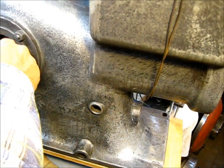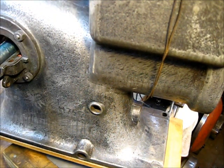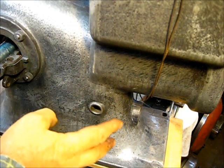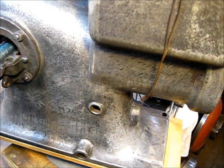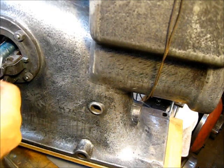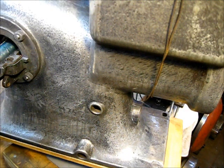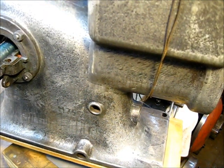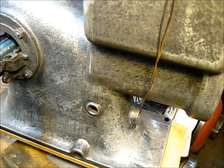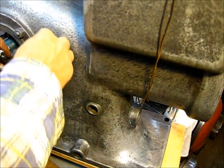In this case here, if I had to replace a shim in this one, I would definitely have to find another shim, because it wouldn't wear the 15 thousandths. I'd like to take a 10 thousandths out and put a 5 back. The same way over here, I ended up with a 10, a 16, 11, a 10, and a thick one on this side. Okay. I have taken off and put on there, like I say, to verify that that's the amount that I actually needed.